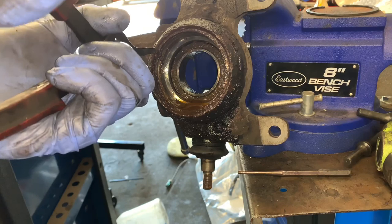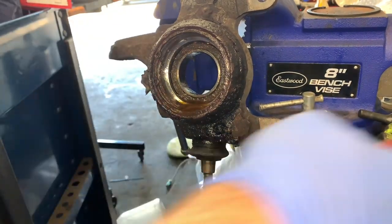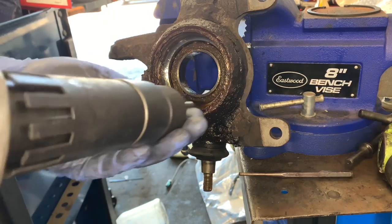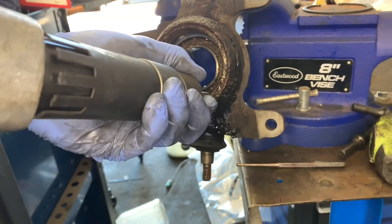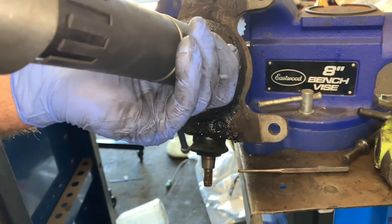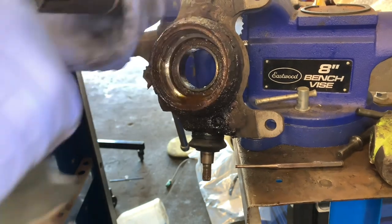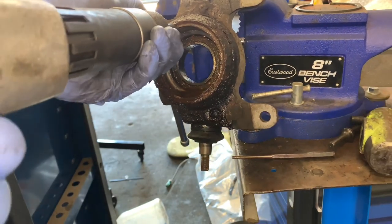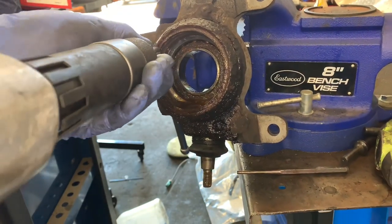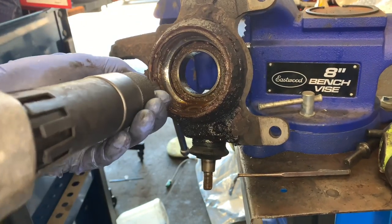The first step I tried, like anybody would, was with the snap ring pliers — clearly it's frozen. So with an impact hammer and a chisel bit I went ahead and lightly vibrated on the snap ring all the way around it. What I'm trying to do is vibrate the snap ring loose, break it free, and let that penetrating oil work into the pores of the rust and metal to loosen it up.